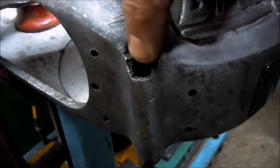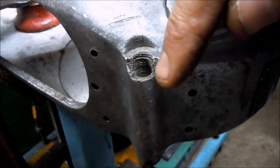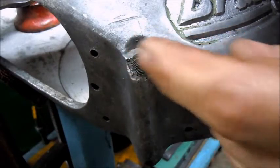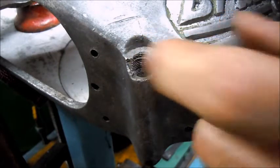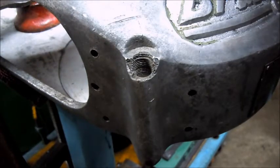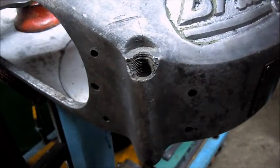What I thought I would do is there's a hole which feeds the oil down in the bottom. I thought I would make up a slug that fits that smaller diameter down in the bottom and then comes up inside of the threads, which will give me something to build up the aluminum around, as well as keep aluminum from going down inside. I want to do as little machining work after as possible — just maybe clear it out and then re-tap it. I'm going to spin up a slug to go down inside of there, and maybe even put a quarter-20 in the top so I can put a slide hammer on it to pull it out after.